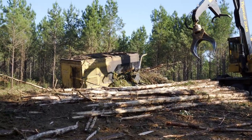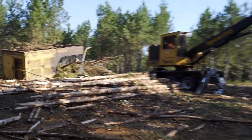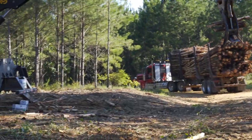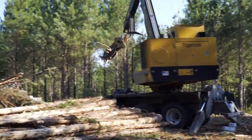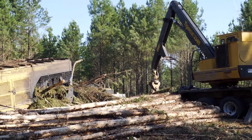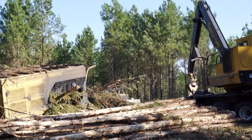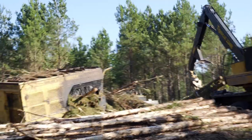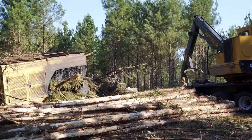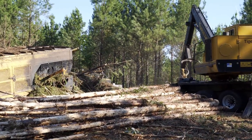And like that there, the top came out close enough without having to top it. He didn't have to put it back to the saw. But anyway, he's having to be careful on what he does with his tops and stuff in the delimber, the pull-through delimber. Because it'll throw his chain off if he hits - if a limb springs back when he's going through there, it'll hit that chain just right and knock it off. So sometimes he's having to put it through the box first, spin it around, then put it back through his pull-through to cut the tops off where the mill wants it.